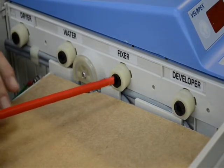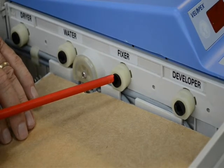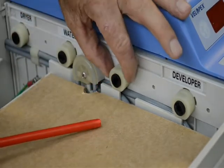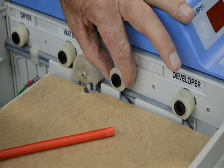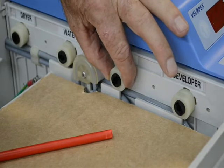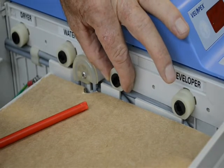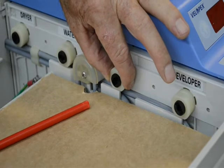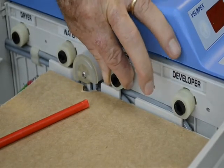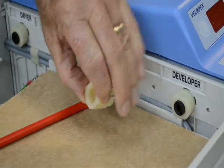We're going to work on the fixer one here for demonstration today. All four of your drive dogs are identical in the way they're shaped and operate. To get started, we simply grasp the outside of our bonnet — the light-colored piece here — and we're going to turn it counterclockwise less than a quarter of a turn. After we turn it a quarter turn, outwards it comes.